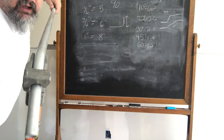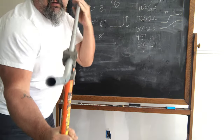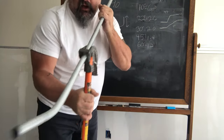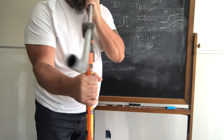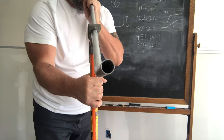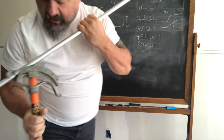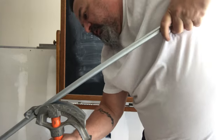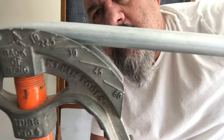Now take the pipe, rotate it 90 degrees, bring it out, match up that second mark in the bender. Look down the pipe — you don't want it to be dogged, you want it to be parallel with the bender. There's a neat little tool for that, but this looks about right. Do that same thing again — take it down to the 30-degree mark on the other side.